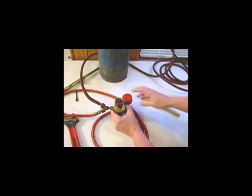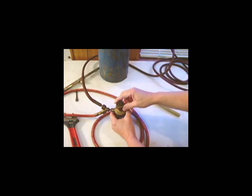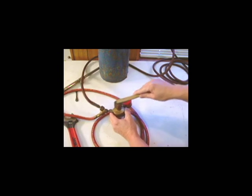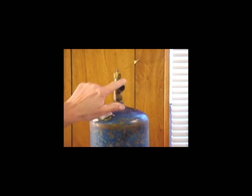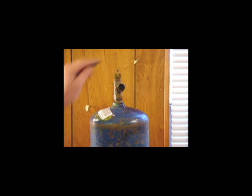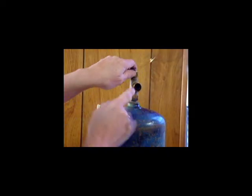I've just undone my gauge and pressure cap valve from my tank, and I want to check this fitting to see if it's corroded. It has a little bit, so again I'm going to take a metal brush and clean it. When you get a new tank from the welding supply, it should have a cap on this valve — just pull that cap off and it's ready to go. Sometimes you want to open it a little bit and blow it out to remove any debris that might be stuck in there. Now it's ready to have my valve put back on.